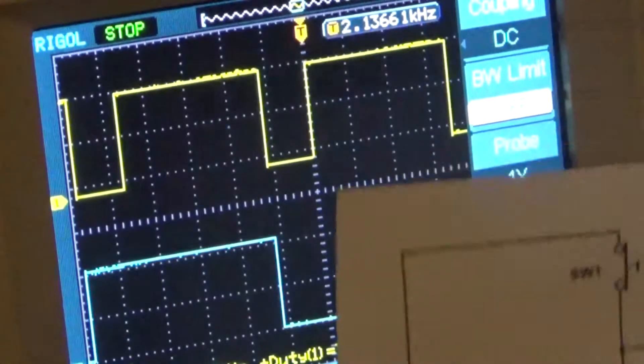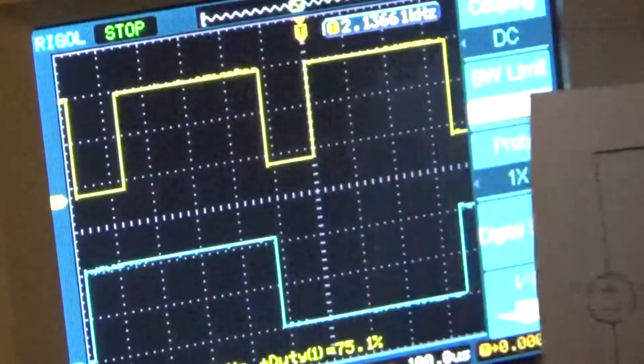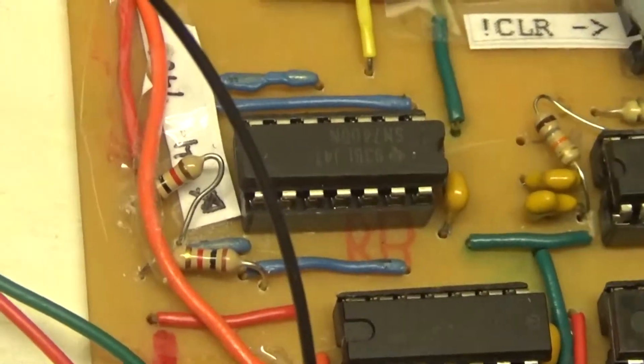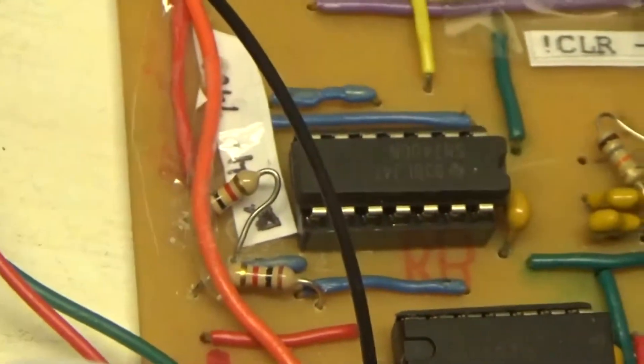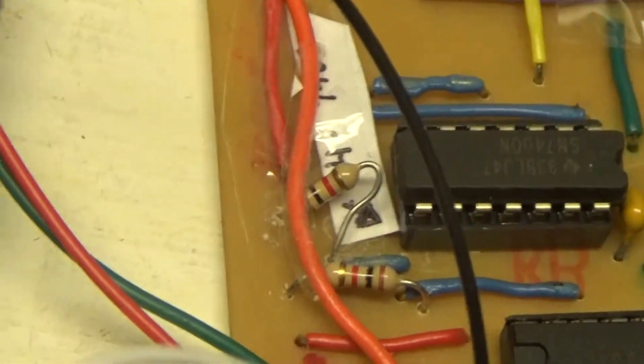Here's a little circuit of an RC debouncer. You can try to add that into the switch lines. I threw in a couple of resistors there, pulling pin 9 and 13 high, and that seemed to debounce it. I don't have the capacitor in there and it's only 1k resistors. It might be better with the 10k voltage divider method with the capacitor, which is in this circuit here.